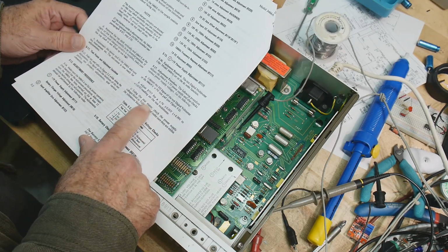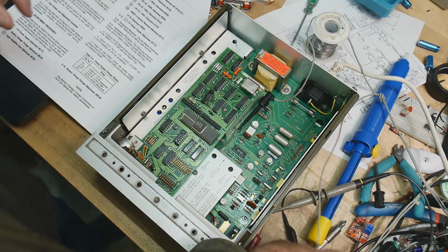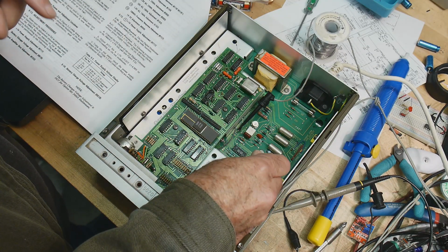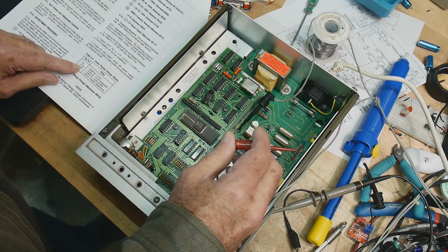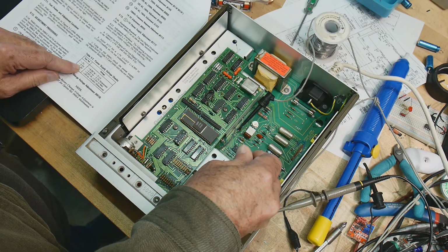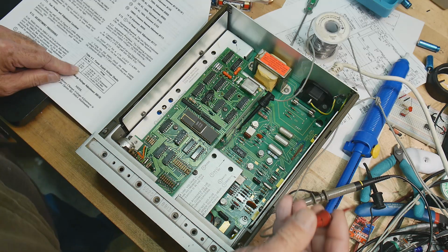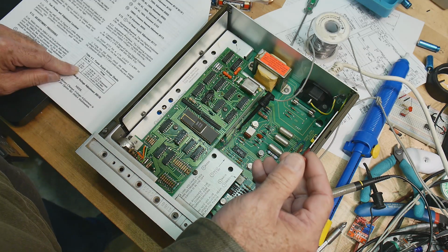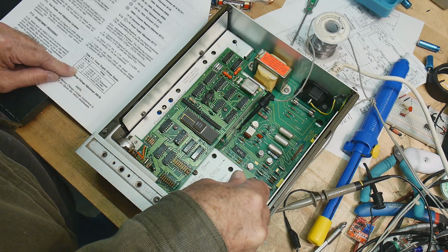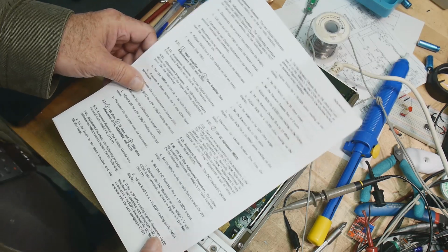Okay. Using the test meter, check the power supply voltages. Now we get to check the minus 7. It's now measuring minus 7.07. That's within spec. And then minus 2.5, 2.6. That's within spec. Plus 3, if we have a battery. We don't have a battery, skip that one. And then plus 5 is here, and that's measuring 5.008. Very good. So that's all adjusted. We do not have the battery option.